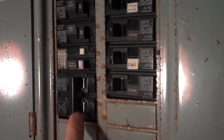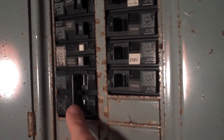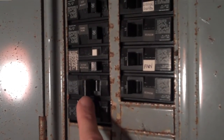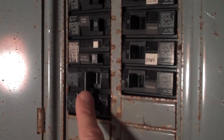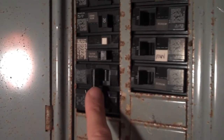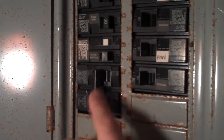I have filled up a bathtub up to the overflow level, which is between 25 and 30 gallons, and I have turned off the power using this 30-amp breaker in my house to my grinder pump. Then I let the water down into the pump, so the pump now has that 25 to 30 gallons of water, which will bring it up to the alarm level. But the alarm can't go off and the pump can't run because the breaker is off. When I turn on the breaker, the alarm should sound and the pump will start running. That's the test.